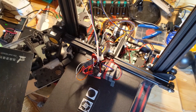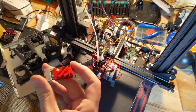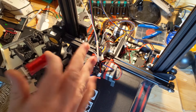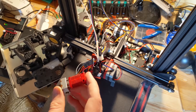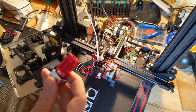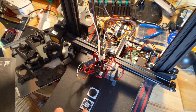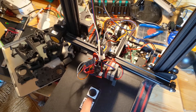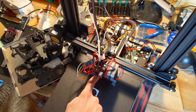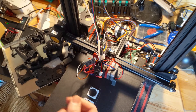For printing ABS on a machine like this, your original hotend is just not gonna cut it. It's PTFE lined in there, which makes for some really nasty smells above somewhere around 240 degrees, which you're not gonna want to breathe in — if I'm not mistaken those are neurotoxins and will severely harm you. So this thing, toss it. I've printed on this printer for a good while with an E3D V6 Lite, but that thing's also PTFE lined and can't really handle the temperatures you're gonna need. So instead I went out and bought a Dragon hotend, which can handle all those temperatures, but there are hundreds of full metal hotends out there you could choose from as well.